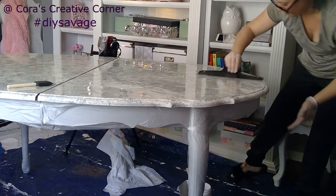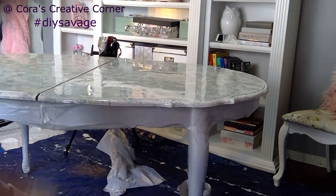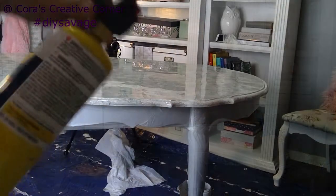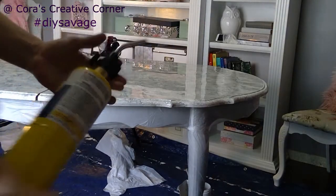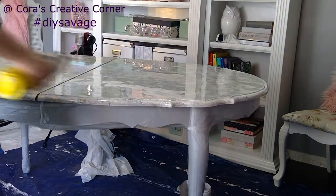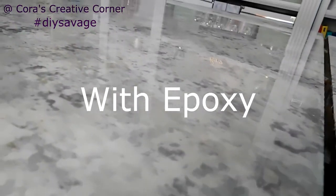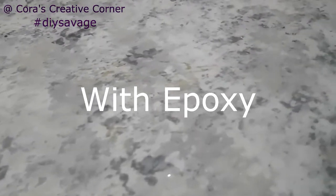I try to wait at least 1 to 2 full weeks for it to be solidly hard to put heavier items on top of. Now, anywhere between the first day or 2 of use, anywhere up to 2 months of use, if you put something that's got a heavier weight on it, it might dent into your epoxy, kind of like carpet does if you have heavy furniture on it. But if you remove the item, you'll notice that it will also lift up like carpet. Now, that I've noticed generally within the first 2 months. After 2 months, I haven't noticed any type of give. It seems like the thicker the epoxy is, the longer it takes to fully cure and to get hard like glass. So it's going to be different for everyone depending on how thick your epoxy is, okay?